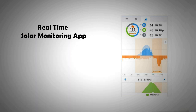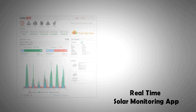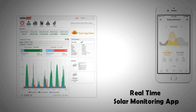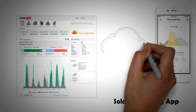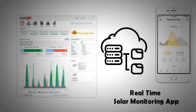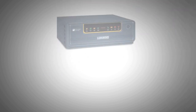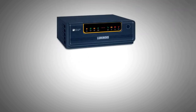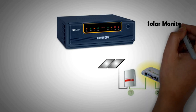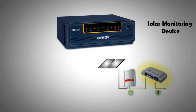Another development during the last 10 years is the monitoring technology for solar panel output, which you can now add if you don't already have it. Many high-end solar inverters come with fantastic software that lets you monitor the production of your solar array. They also store data to allow you to compare power output to any time period in the past, generating reports for weekly, monthly, and yearly production. For people with an older inverter lacking monitoring features, many suppliers now provide devices that connect to your solar installation and allow you to monitor panel output on your phone anytime and anywhere in the world.